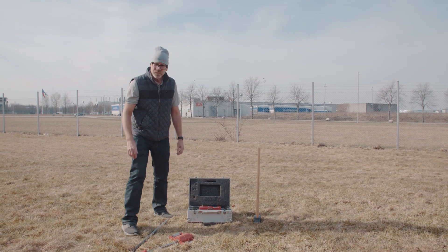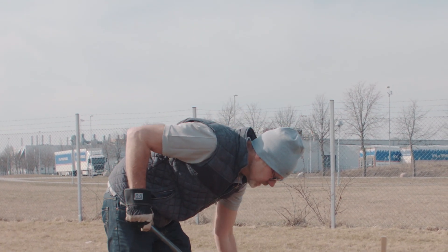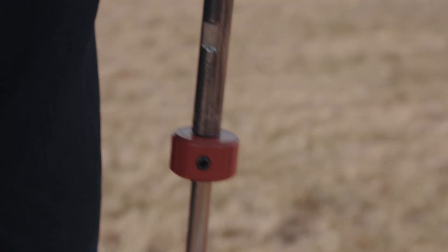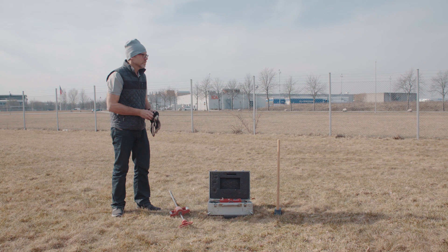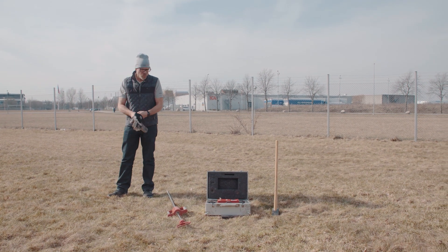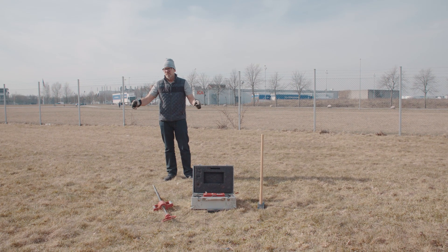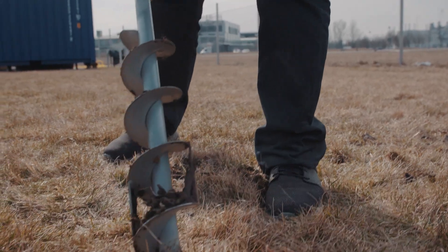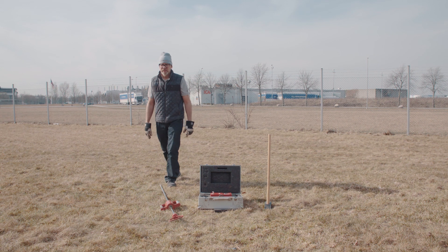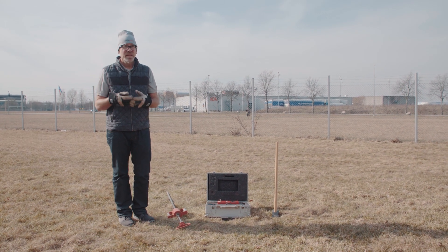So now I will start to mount the sounding tube into the soil. The first thing I will do is try to attach this to the sliding hammer. Now it is the question of finding the right spot. In this area you see it is quite similar but you cannot be sure about the permeability in the soil. So normally you dig a hole, a bigger hole like this, and you can try to determine what kind of soil material it is — it can be gravel, it can be clay, it can be sand. I have confirmed that it is actually clay here down, so it is a little bit complicated. I will explain why it is a little bit more complicated when it is clay compared with soil material that has high permeability like sand and gravel.